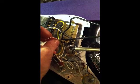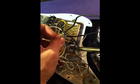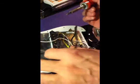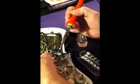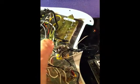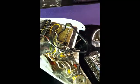Because it's attached to the back of the pot, I'm having to heat a lot of metal there. Okay, that one came off pretty easy. But what I'm afraid of is this large glob of solder here not only has this ground wire, but all these ground wires attached to it. So I'm just going to cut that off. It's not a problem. There's still plenty of wire there to work with.